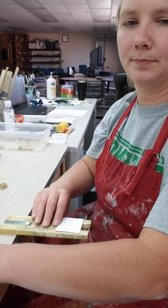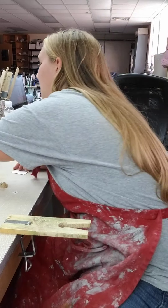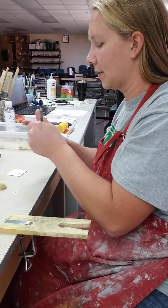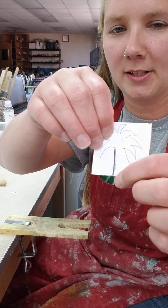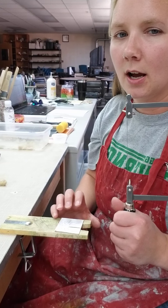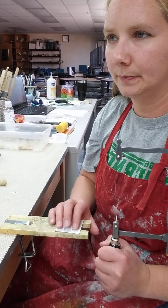Where I'm going to cut, I'll start down along my edge. I have one straight line and the rest are curves, so I'm going to saw my straight first. As I'm sawing, be in tune with the sound of the blade — you need a whoosh, whoosh motion as you're sawing. You should actually hear the back and forth; it's a higher-pitched sound.